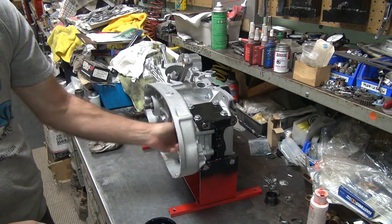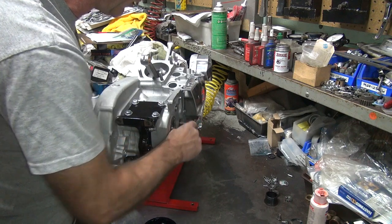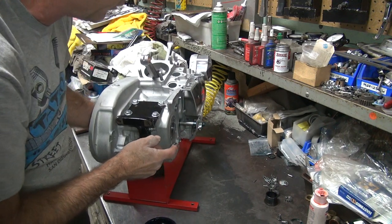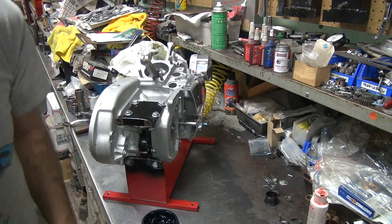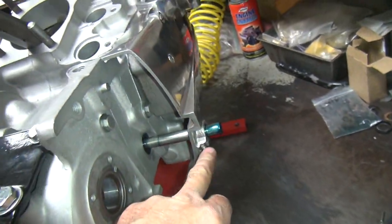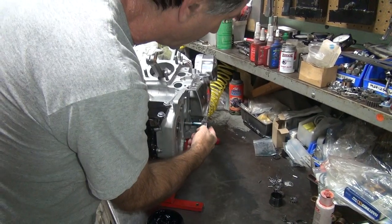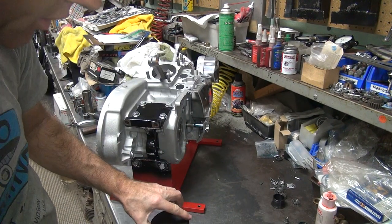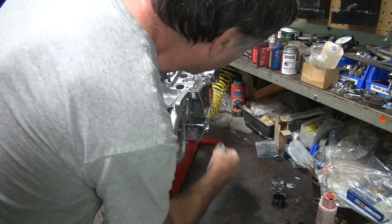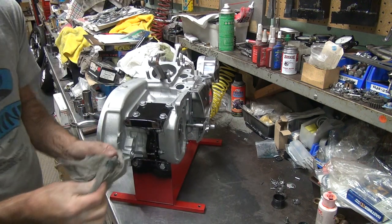Stick it in the hole, wiggle it a little as you're going in. When you get over here, stop and put some new grease on it because the seal wiped off what you had. Go back and forth a few times in both directions then wipe off — get it well lubed in there. Usually nobody hits these with a zerk fitting — this is lifetime lubricated. You probably won't see another drop of oil or grease in there for the next 20 years unless there's a massive oil leak. That's why those bushings don't live too long — pretty highly loaded and you don't get much lube.